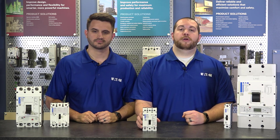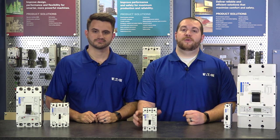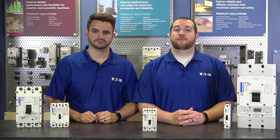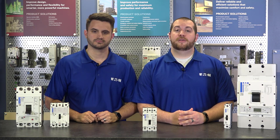This globally rated circuit breaker provides thermo-magnetic protection from 15 amps up to 125 amps. Frame 1 is available with interruption ratings up to 100kA and even has a 100% rated current option. It features through-cover accessories and is the most compact frame available in the PowerDefense family.